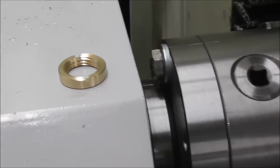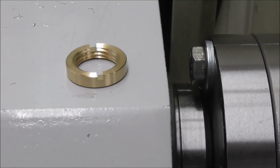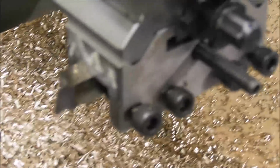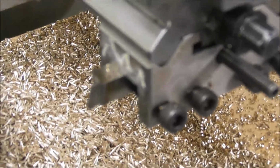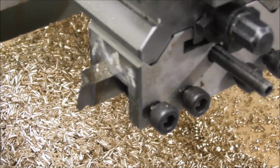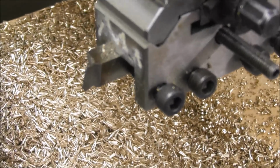And those little drive slots are about 1.3 deep and about 1.8 wide, I think. And I wasn't sure whether it would work. I didn't know whether I would be wasting my time trying. I didn't want to have to worry about locking the spindle each time. I wanted it to run automatically, and I was a little bit worried that it would turn the chuck and we'd have an El Cruncho meltdown.